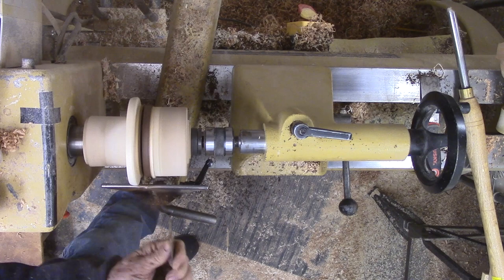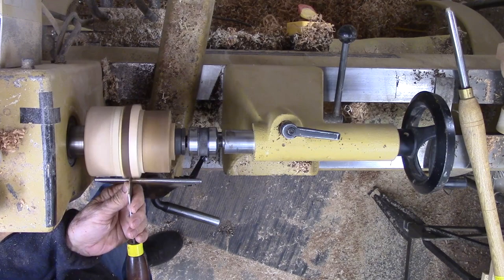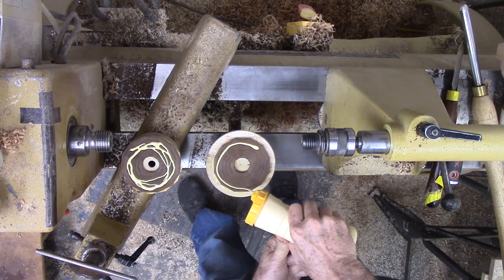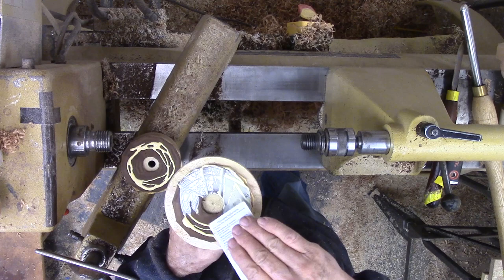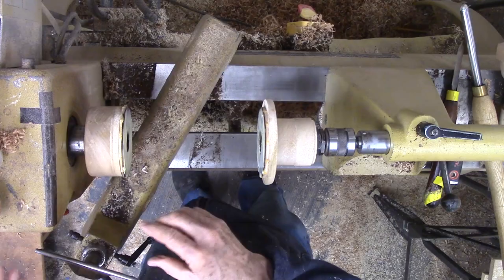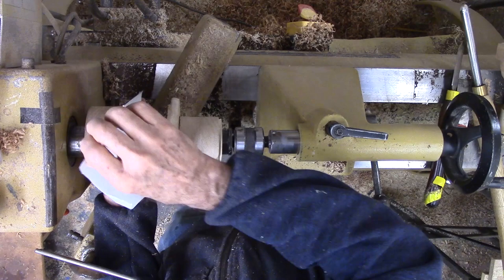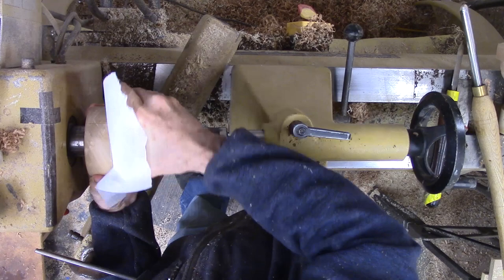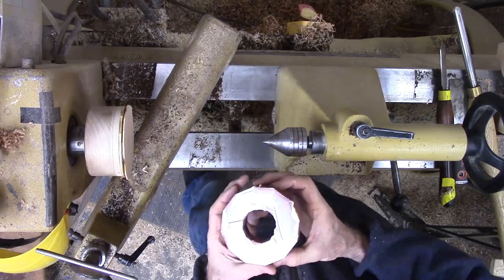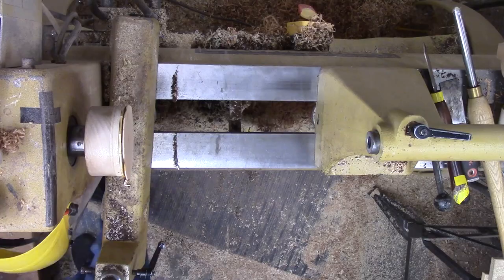After the glue is dry enough, I can part the dark ash. I chose a point a little larger than my target width on one side, then part it off on the opposite side. A trip to the metal lathe cleans up any roughness on the surface - again, this could be done at the wood lathe. Now for a more complex glue-up. I want a layer of veneer on both sides of what will be a center core. Veneer is tricky to glue because it loves to warp when glue is applied. I spread glue on both dark ash and two pieces of veneer. I pressed them together with a layer of parchment between them and let this glue dry much longer because of the veneer's tendency to warp at this thickness, keeping it in clamps for much longer than for a plain segment ring. Time for the center ring. I spread glue expecting to use the cone center for positioning. However, I forgot that the maple veneer does not have a center hole to allow the cone center to go in while positioning the next ring.